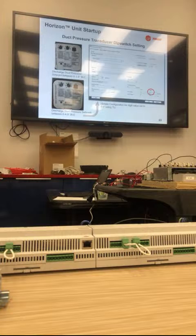Right. So a sensor failing can cause that, and also not changing this configuration file. I'm not saying that was the issue, but if you don't change that configuration file and you have the set point at 2 and it's set at 2, it's going to run wide open, blow up ductwork, everything, which is why we're trying to highlight this.